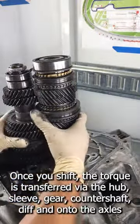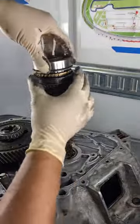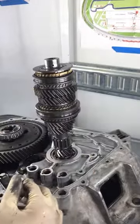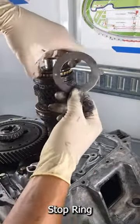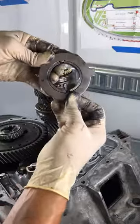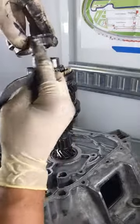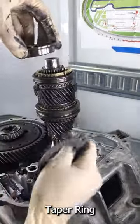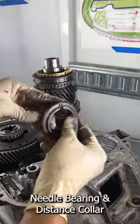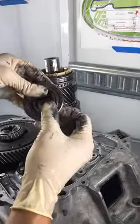So let me take this all apart real quick and I'll show you guys. This is an angular ball bearing right here — you just take that thing off. And then there's a small stop ring, and the stop ring has these little detents in it to stop it from rotating around, and they fit into it just like that. And this thing just comes right out here — this is shaped as a taper, it's actually called a taper ring. And then that fits on a needle ball bearing. And this is just a distance collar.